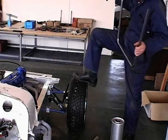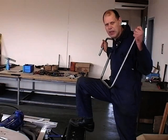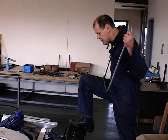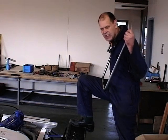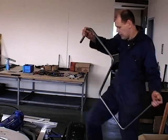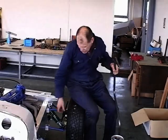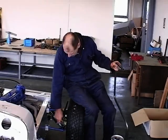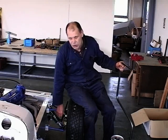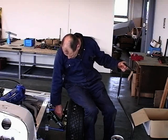we've perfected the cycle wing brackets now on the lightweight after many years and probably a dozen different types of bracket. But we've still got a slight problem, is that every set of wheels that people fit, it means they're in a different position to the base brackets that's on the car. So you can see that is the base bracket. And we've got its solid 18mm bar, and that's welded quite substantially via an additional bracket to the stub axle adapter. So there's some quite substantial weld there.